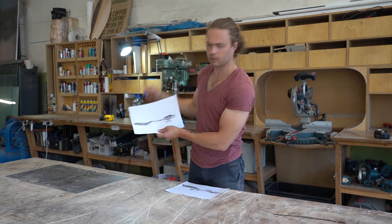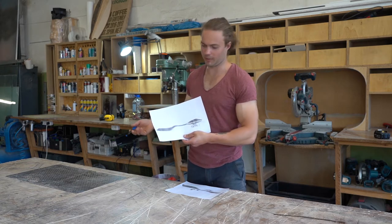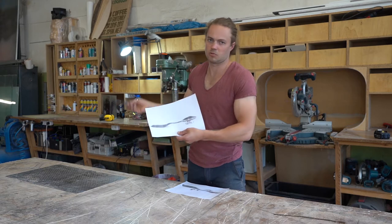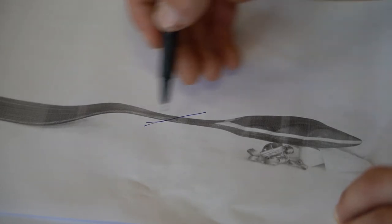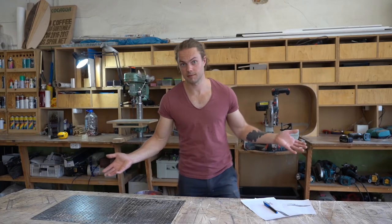And when I look at it now, I probably made a mistake selecting the wood to begin with, because if the grain would have gone along the stem, it should have held. If I remember correctly, it broke somewhat like that, so that means the grain direction was going this way. Well, anyway, all I wanted to say is that grain direction matters a lot, especially in tiny projects like this one. Okay, so let's stay mindful and begin the build.